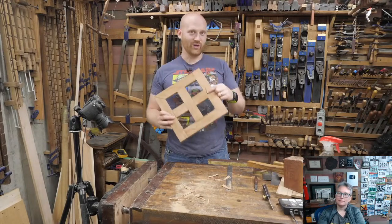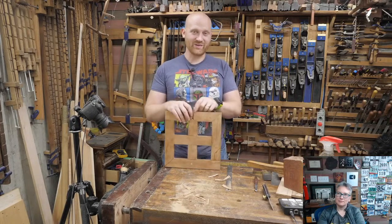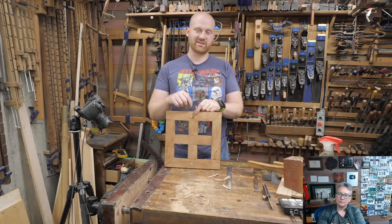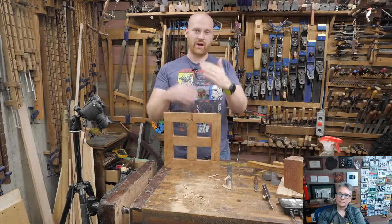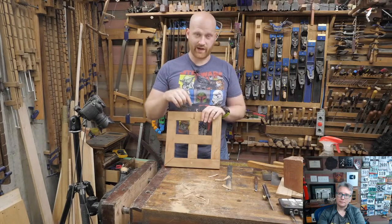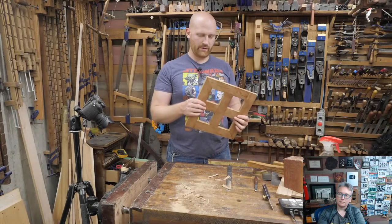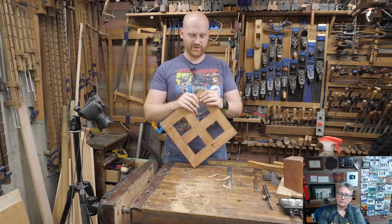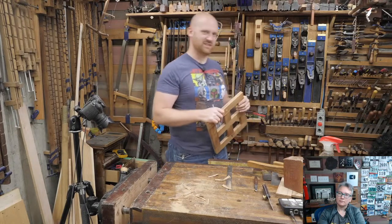And then after that, we are going to be doing the pocket hole. I know, I just swore. But surprisingly, pocket holes are actually a very old joinery. They are some from as early as the 1600s because they are very good for doing cross-grain joinery. They allow flexibility, so it's actually very good for a skirt to a tabletop, and you'll see a lot of old bits for drilling out pocket holes. And then our last one is the splined miter joint, which looks simple, but it ain't. It's deceptively not.